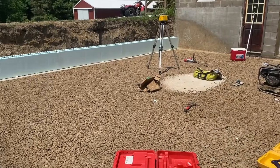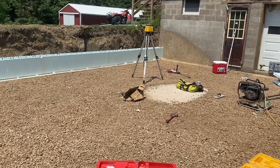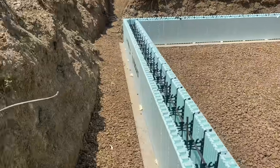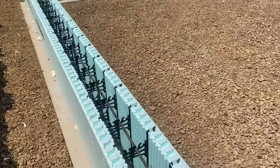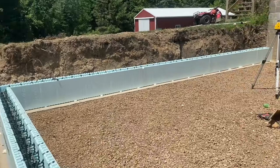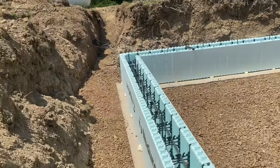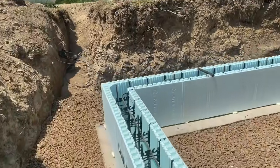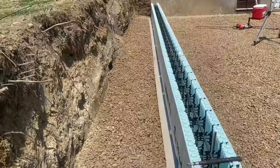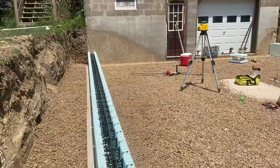And you can pour your floor like I've showed you on other videos. You definitely can pour that floor. It does not move this first course. Don't worry about that course moving once it dries. It doesn't work good if it's wet out, but if it's dry like today and it's 90 degrees, we're going to eat some lunch, and by the time lunch is over, this bad boy is going to be rock solid. And we're right on our line, so good to go.